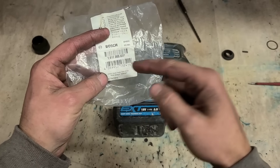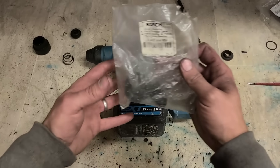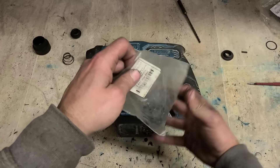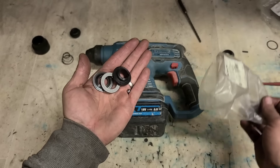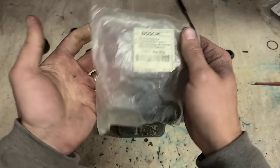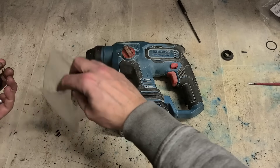This part number with Bosch appears to be obsolete — that's for an older 2000 model corded drill. The kit you actually want is this one here. That's the number for the Bosch 18-volt brushless machine, just like this. That's the exact same kit, just with a different sleeve — all the other bits are the exact same. So if you have an Erbauer drill and you want to fix it up after the chuck falls apart, go online and order that part from Bosch or wherever you can get it. The only parts you don't need are the sleeve, the spring, and the cap — everything else is compatible and will fix your Erbauer drill up, no problem.